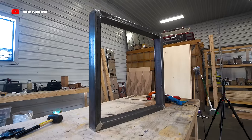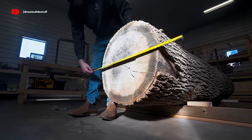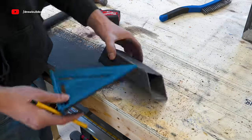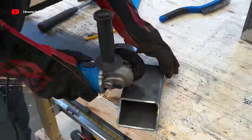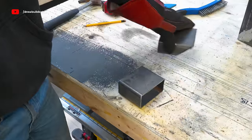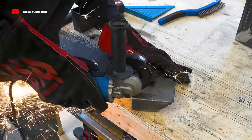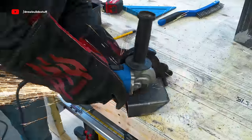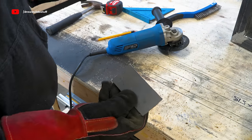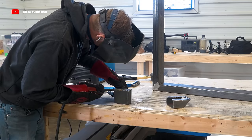I based the size of the square off the width of the log, and I'm measuring it up again to make one little piece of steel that goes on the bottom of the square to hold the log up. This way the log's full weight rests on this steel pedestal rather than being suspended by just threaded rods or bolts — the bolts will just keep it from falling off. I cut a custom-sized piece for each end, traced it onto scrap steel, cut out a cap plate, and welded that onto one end of the tubing.